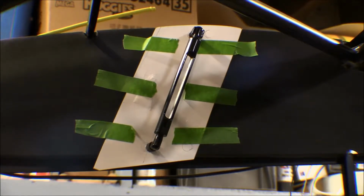I'm going to have to do a little trimming on it because those 2 wing roots are a little bit different. This lower section here hangs down almost 1 inch on the back side and about 1/4 inch on the front side of what this one on this side did, and the top is up just a little bit higher than the top of the rib there, so we'll have to do a little bit of trimming on that, but anyway, that's coming along nicely.